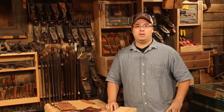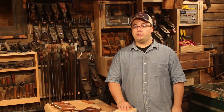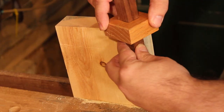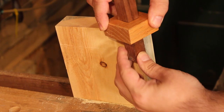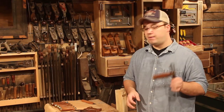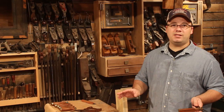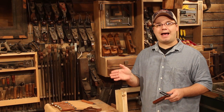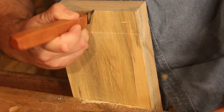Now that you're an expert on all the back saws, you're probably expecting me to just whip out a dovetail saw and lay right into this 2x6. A 2x6 is a little too thick for a dovetail saw with that fine of teeth — when I'm cutting this much meat, I like to use my carcass saw. We set our marking gauge to the thickness of our leg and mark all the way around the ends of the mating top piece. The traditional angle for a dovetail in softwood is 1-in-6, which means you line up your bevel gauge on the 1 and the 6 on your carpenter's square. You don't have to use a bevel gauge to mark the angles — if you've cut a few dovetails, you could probably eyeball the angle. I still like to mark mine out, but I do eyeball the spacing because with only two tails per joint, it's pretty hard to mess that up.